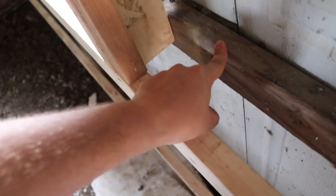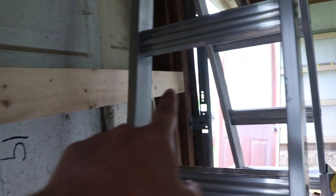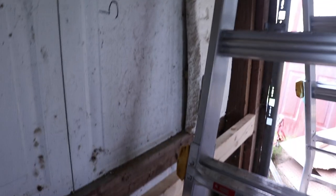I had to put a 2x4 tacked on in between the original 2x4s that they tacked the tin to for the exterior and the inside one. I wanted to make sure the spacing was proper, so I sandwiched a 2x4 in there — that gave me something to tack to running from that post to here. The closest board otherwise would have had incorrect spacing and the tin would have had a swoop to it, which I didn't want. Everything up there is all tacked up and good.